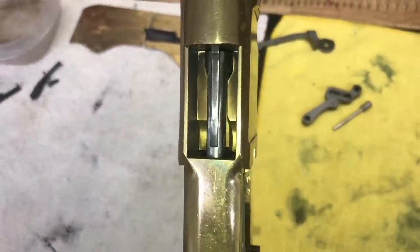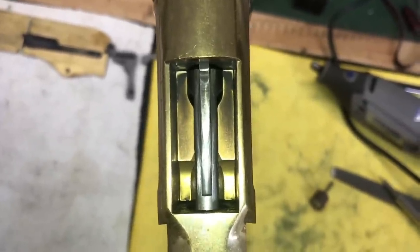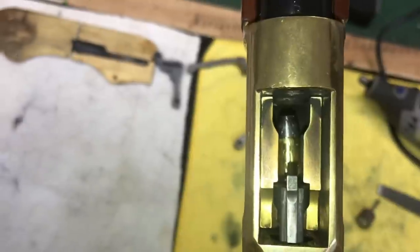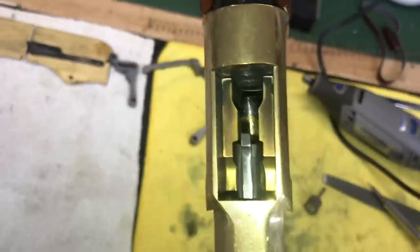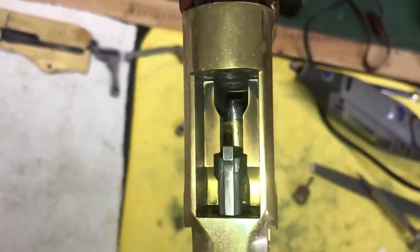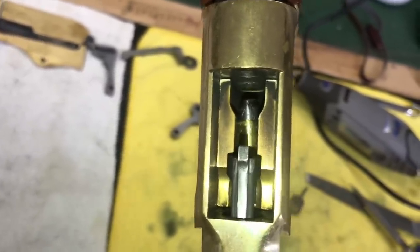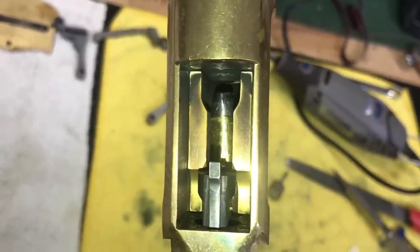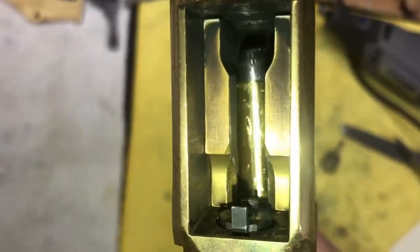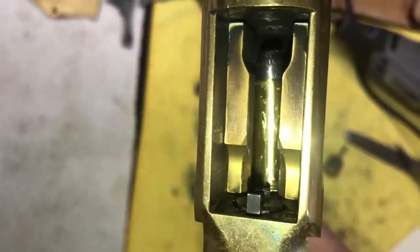At this point, we need to check the second stage of the timing — this is where that dummy round comes into play. I've placed the dummy round into the carrier, seated it in there. Because this is an 1866 with the side plate off, it doesn't have as much retaining space, so keeping the gun at cowboy port arms at a 45-degree angle ensures the round stays at the lowest point in the back of the carrier. As I throw the lever forward, the bolt retracts and the carrier comes up. We want to make sure that the little tab on the bottom face of the bolt misses the back end of the dummy round as the carrier is coming up.